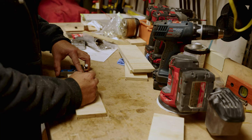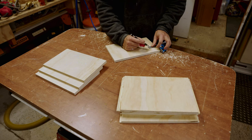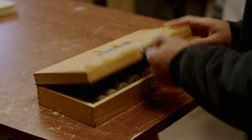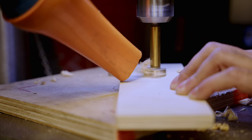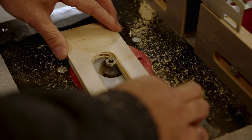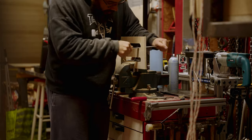The next thing I did was cut the handle holes in the full and half Apple boxes, as these were easy to do while the boxes were apart. I laid out my desired handle pattern on all the pieces — I just looked at common Apple boxes on the market and kind of made it up on the fly. The method I used was a one-inch Forstner bit to make the rounded edges of the handles, and then connected those lines using a jigsaw. These weren't the straightest cuts, but with a round over and a lot of sanding, they turned out pretty well.